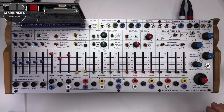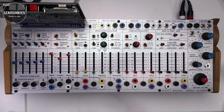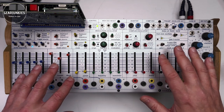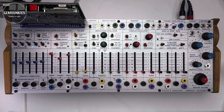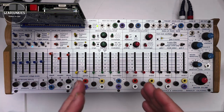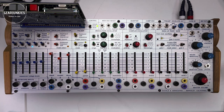The Command version sits in a nice wooden fold-out case with two master jack outputs, a USB interface, a MIDI in, CV gate in, and options for a USB host controller, among others. Essentially, it's still the same 1973 easel, which is fully analog and consists of a number of sections with two oscillators, an envelope, two VCAs and filters, a clock circuit, random generator and five-step sequencer. There's also an analog stereo reverb built in.